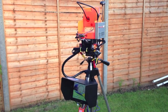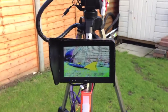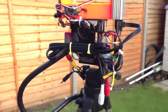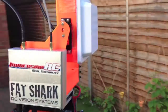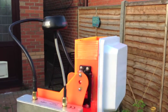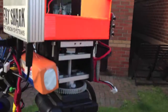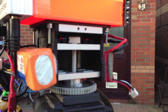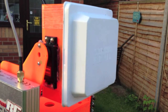I'm now going to show you the antenna tracker. It has several components to it: an LCD screen for actually seeing the first person view, we've got the 5.8 Duo receiver, we've got an antenna on the top there, and we've got a circular polarised patch antenna. We've got a 50kg torque 360 degree servo to do the pan, and just a normal standard size servo to do the tilt.